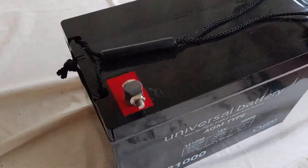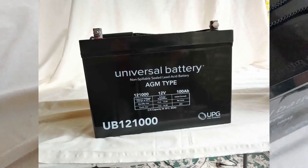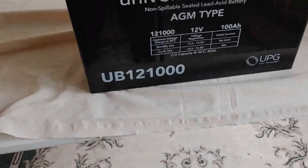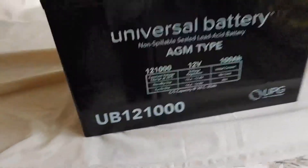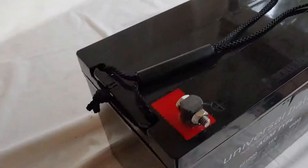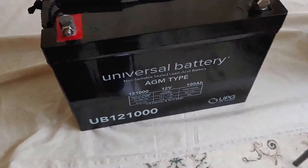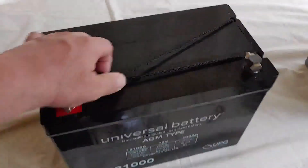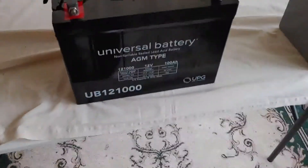The next one is the typical AGM battery — Absorbed Glass Mat. All AGMs are not the same; you must make sure the AGM says it is a deep cycle, because they make AGMs that are not deep cycle. Now, let's talk about the cons first. They are expensive — much more expensive than your standard flooded battery. And they are extremely heavy to move around, so you'll want to have a way to get it in place and then leave it there.